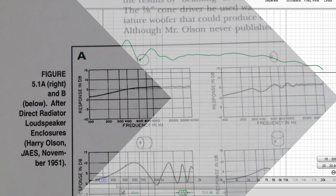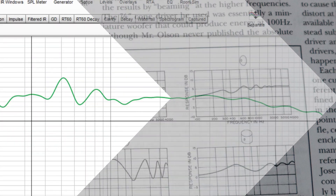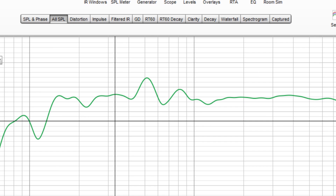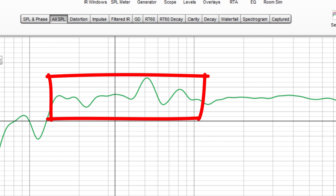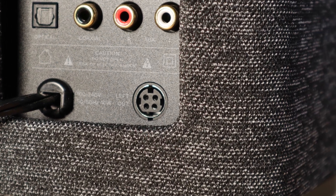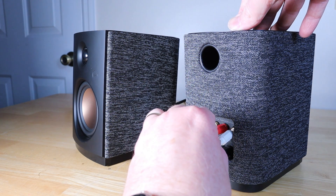Let's go back and talk about the lack of a baffle step response. Instead of the gradual fall expected by baffle step theory, we get a gradual rise giving us a little more mid-range and an otherwise relatively flat response. That's because these powered speakers have a DSP inside, and it appears Hivi Swans added EQ to account for the baffle step. There are four pins in the connector for the left speaker — a pair for the tweeter and a pair for the woofer — so there is some type of crossover network in the right speaker. The manual actually calls it a DSP filter.